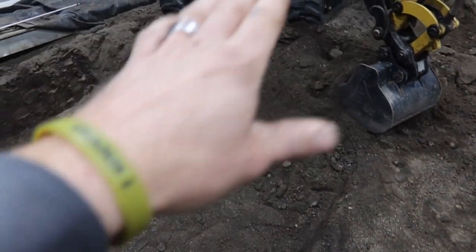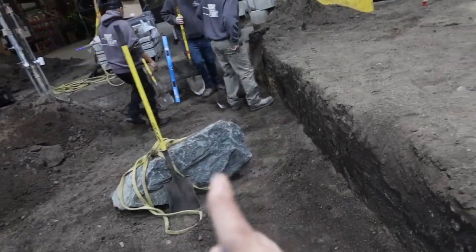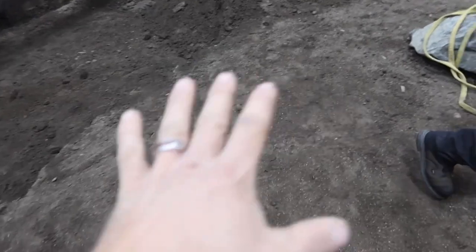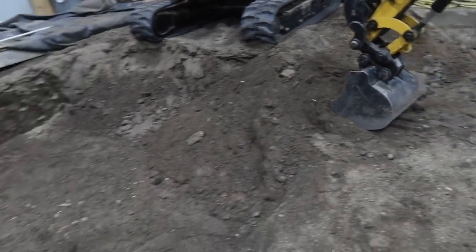the liner. So we're going to leave this pad right here. Dan's going to dig himself just a little ramp so he can get the machine down here if he needs to. But we want to get this entire area prepped and ready because we're going to be running brick walls inside the liner, much like we did back over here in the sphere. So it's super important that this all stays nice and level, especially a 2-foot offset running along our walls. Once we get into here, it's not as important, but it is nice. It'll make for a nice clean look as that gravel lays nice and flat over top of the liner.